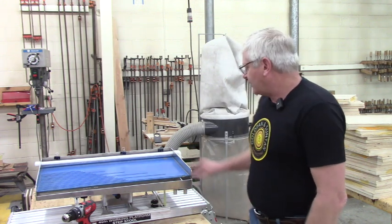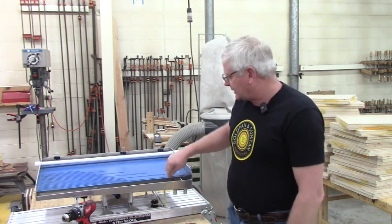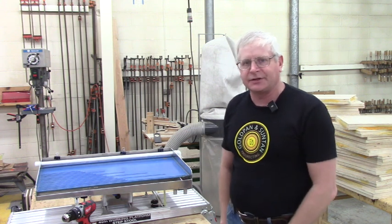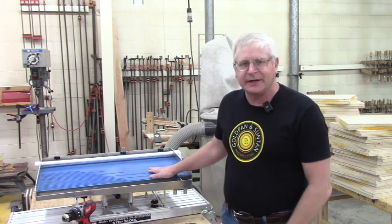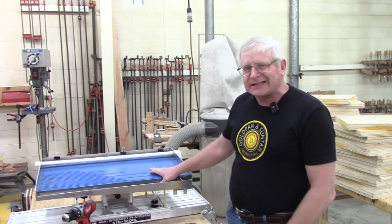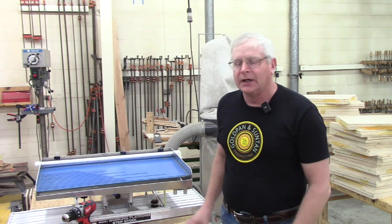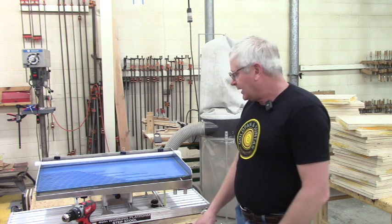Hi, this is Charlie from Path of the Bee. A little update on my shaker table that we've been working on. One of the problems we've discovered is that the main drain out of the sump is just not large enough. I was running mine super slow and it was barely keeping up, and it didn't dawn on me that if somebody wanted to run a larger volume of water it wasn't going to work.